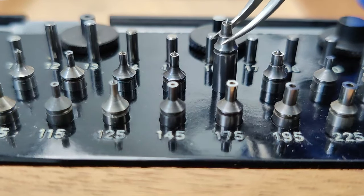Okay, installing the center wheel and the bridge. I'm going to gently pull on the wheel to test end shake. And it feels really tight. And yeah, it's not spinning with air, so we will have to increase the end shake. And as you can imagine, it's an iterative process to achieve the right amount of end shake, but this micrometer dial on the jeweling tool assists with this.